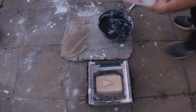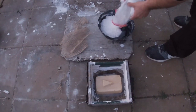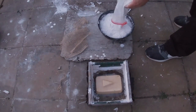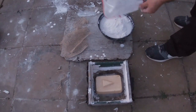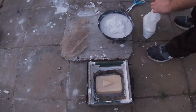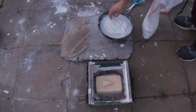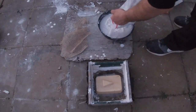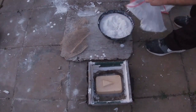All my silicone is done. I scraped it off and put it on my little mold box — I filled all the corners out with some plaster and let that set so that when I pour plaster over this it won't pour out all over the place. Nice wee bag of plaster ready to go. You always mix casting plaster like this — adding the plaster in and letting it soak is the best way. I'll also add a wee bit of scrim because I want to make this mother mold pretty strong, so I'm putting a bit of hessian into the back to reinforce it.